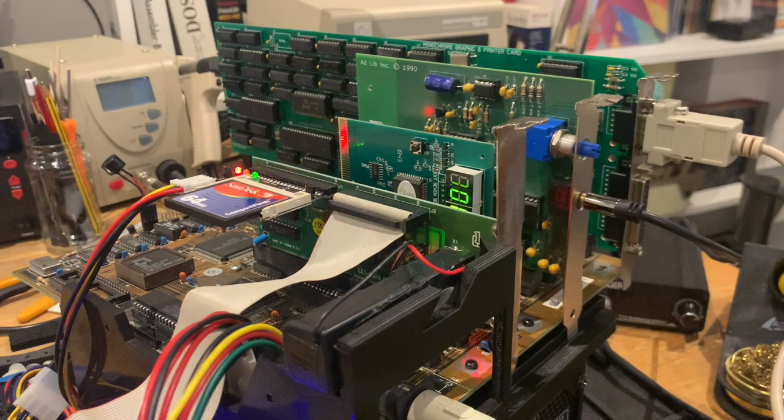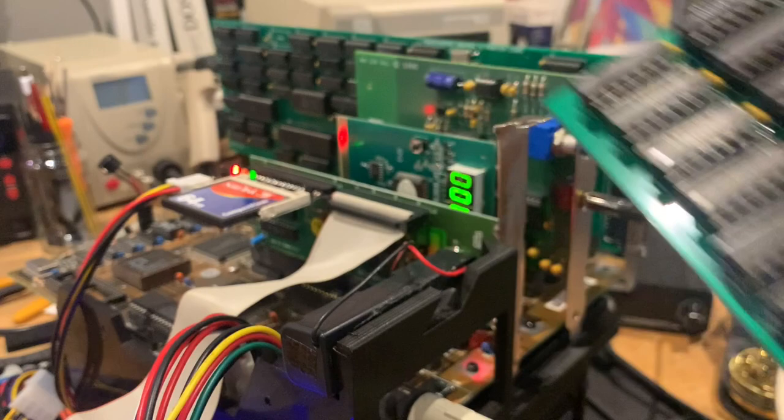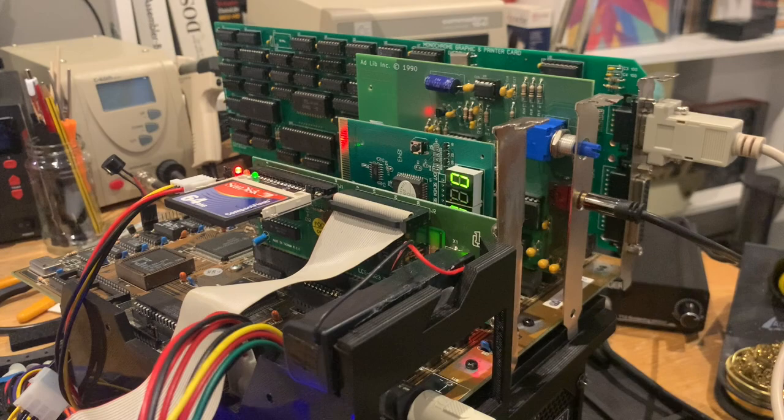However, one additional thing that you have to keep in mind is you can install a Hercules card together with a CGA, VGA or EGA card and have two monitors at once on an MS-DOS machine, which can be used, for example, in Turbo C, which I use in my Let's Code MS-DOS series. Basically you can have the monochrome card where Turbo C runs and then your graphics that you're coding run on the EGA and VGA, and you can interactively debug using the integrated debugger, which is pretty nice. I used that back in the 90s when I was a student to be able to do coding and debugging under MS-DOS without any multitasking. And that's actually pretty neat.